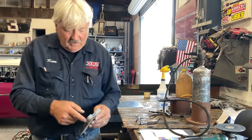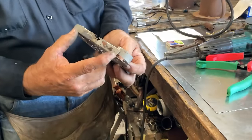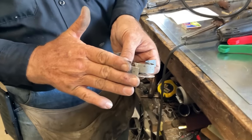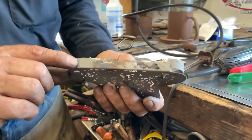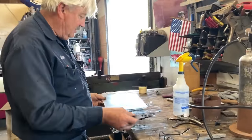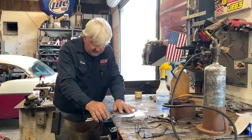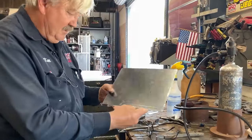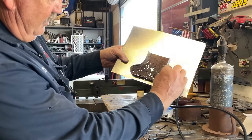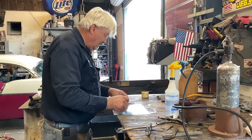The letter has this edging soldered to it all the way around, but on the bottom of the letter there's a straight section. The people who made the letters 110 years ago bent that around. We can see the seam right here, so we found a piece of metal on the shelf - this is five-eighths - so we're going to set our scribe at five-eighths. I've marked five-eighths of an inch up from the bottom and we're going to trace out the damaged part, leave this intact so we can bend it up, then lay the old one on top.